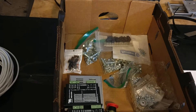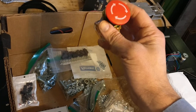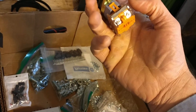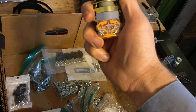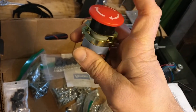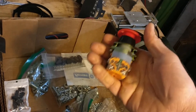One thing I am missing here are a couple of drag chains for actually routing the wires and the plasma lead. I know I'll need them eventually, I just haven't gotten that far yet. In the wiring video, I showed a momentary switch as an e-stop and mentioned that that was not ideal. This is more like what you want — when you press it down, it stays down until you twist it to release. The terminals here are not labeled, but by looking at it you can see that green is normally open and red is normally closed. When you hit the button, they switch — which is a bit backwards from what I'd expect, with the green side being closed when you hit the red button. That goes to show you should actually test your stuff out before you wire it up. One of these will run you about $7 to $10 on eBay or wherever.